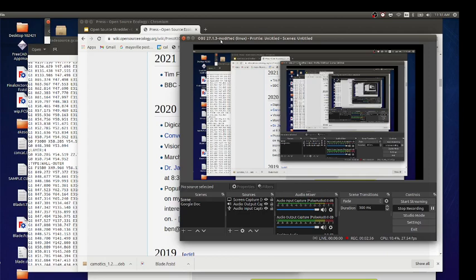When we bottom out, we know we have to reverse direction, and we go so far for both cylinders. The pressure switch is right in front of the valves, so if you bottom out on either cylinder, you feel high pressure right there. Because of continuity of fluid, if you have no resistance, the pressure drop is negligible. Once you bottom out a cylinder, the pressure spikes up to 2,500 psi, the regular pressure of the hydraulics we use. The pumps we have go to 3,000 psi.